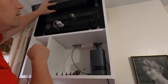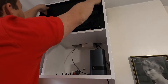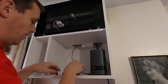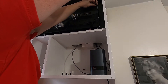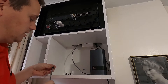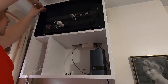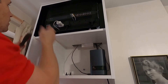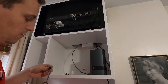Last but not least, the vent at the top — this serves two purposes. First and foremost I wanted a bit of ventilation; the switch doesn't give off a lot of heat but it gives off some, certainly enough that I want to let it dissipate somewhere. It's passive cooling — no fans or anything like that. I'm hoping the air flow around the back with the vents going around the side means heat will rise and come back out the top, which should be more than sufficient.